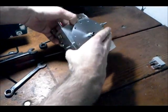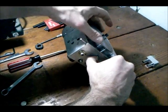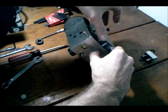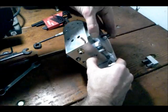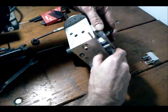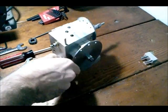Here's my rapid indexing — I've got a little pin here and this pin will engage as I turn. I can do rapid indexing and make any rapid indexing plate that I want, from 2 to 24 — 6, 3, any division that I want. I can lock it in place.